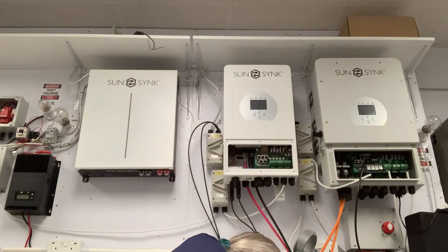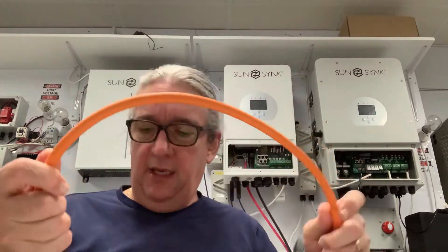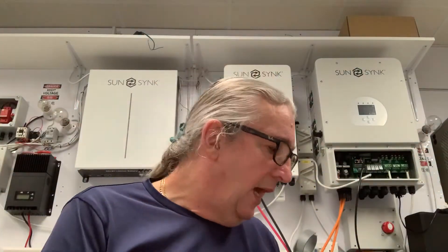Generally most of these commercial batteries come with 25mm cable. You can't take too much power through 25mm because if you're looking at the bigger inverter — the 8.8kW — that can actually pull 165 to 170 amps on the charge circuit. That 25mm cable is too light at that current; you'd need a 50mm cable. So you need to consider the C rating of the battery. A 25mm cable is fine for 50 amps.